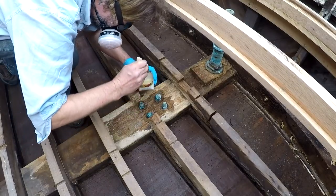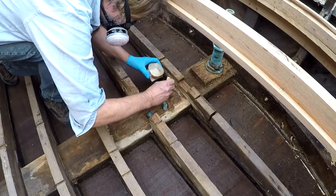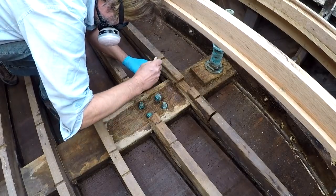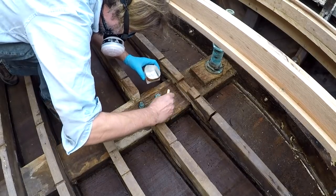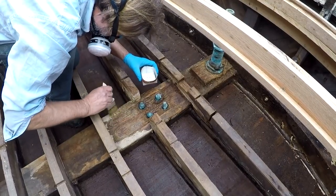So I don't want to lose too much of this wood, thus me being concerned about restoring it. What I'm doing now, after having dried it out for almost a week with a heat gun so it is dry even though we're afloat, is soaking in as much CPES — clear penetrating epoxy sealer — as I can possibly get into it.